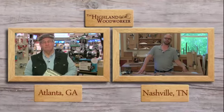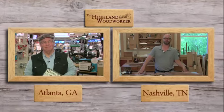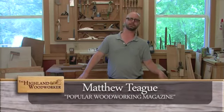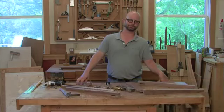Any mortise and tenon joint that you reinforce by driving a peg through both the mortise and the tenon piece is going to definitely add strength to it. But if you're paying attention to what you're doing, it's also a really easy way to have a nice decorative touch to whatever you're making.